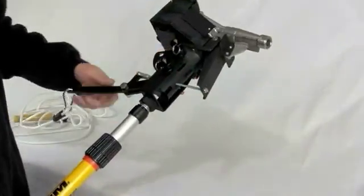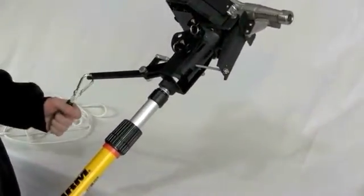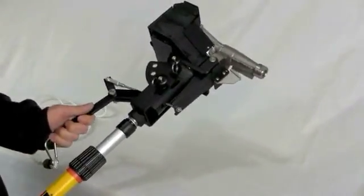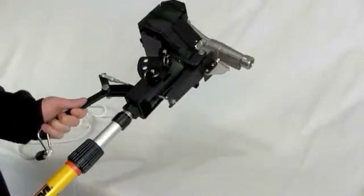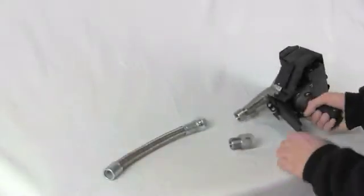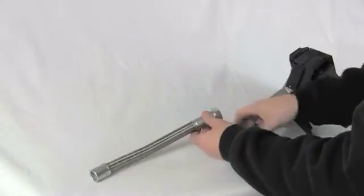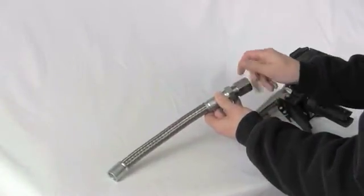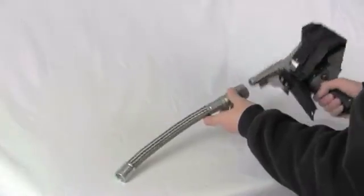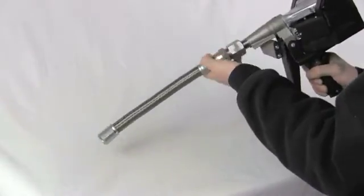To clamp the sensor head to the exhaust stack, pull the rope. Insert pole to the connector. To attach the flex nozzle to the sensor head, first remove the nozzle threaded protector. Screw on the adapter to the flex nozzle. Finally, attach the flex nozzle to the sensor head.